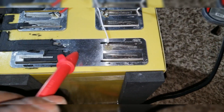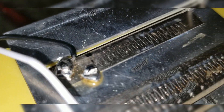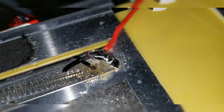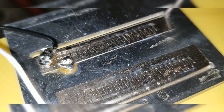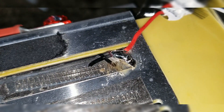Where is the other cell? It's one, two, three - so there are three BMS wires right here. See how poor the soldering is - it's terrible. The soldering iron was too hot. They put one solder, didn't get it the first time, got a second one there. You can see how poorly soldered this thing is. They want an honest review, I'll give them one. They don't have to be upset - I'm just giving them what they asked for. This is the final result - the soldering is really, really poor. It's not like a company that really wants to do something good. They have a lot to improve on.